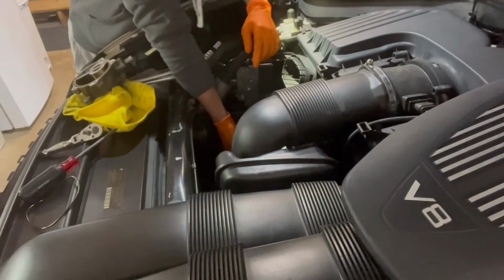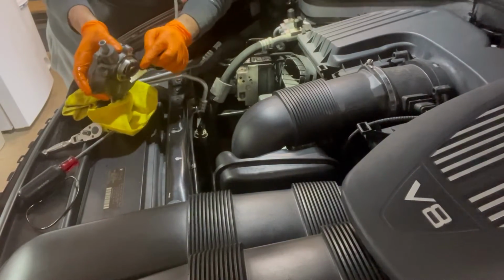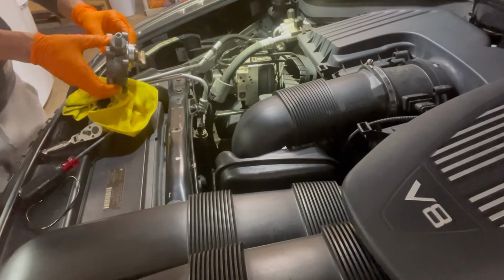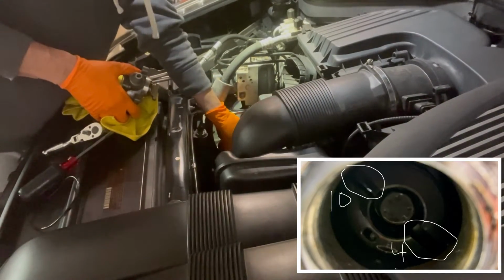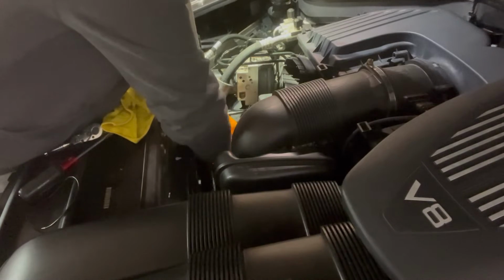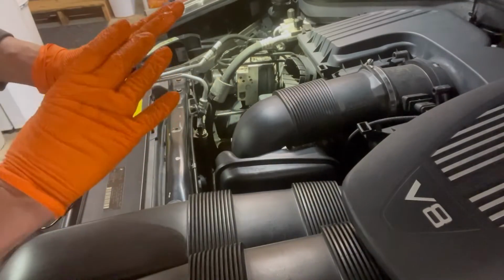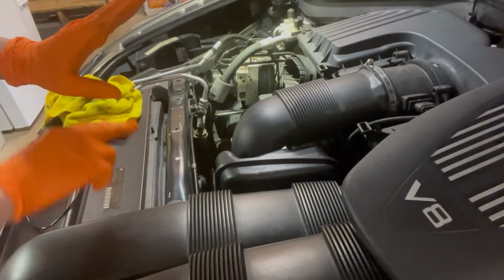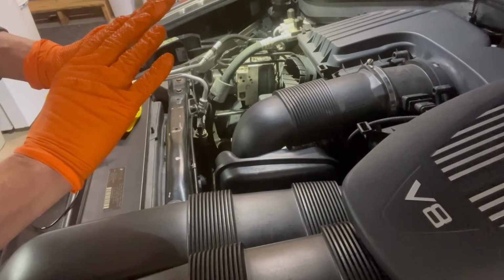So what I'm doing here is I'm feeling where this pin wants to be, and it looks like it wants to be at a 10 and 4 position if you were looking at a clock. So it wants to kind of go like this. Okay, she's in. Make sure that flap slides into that receiving area. You'll feel it in there. If you feel in there, you'll find out about where it's clocked. Mine was 10 and 4. I set it at 10 and 4.